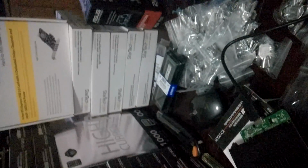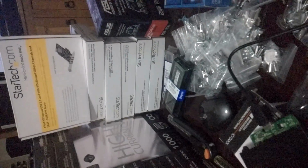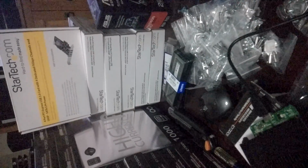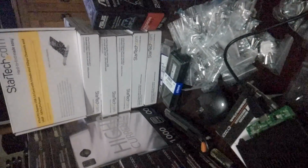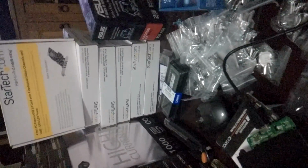And because we're essentially making one giant cluster from all these drives, there's going to be a lot of I/O traffic and just background overhead. I can't flood the controller that badly, because once you start getting to all 30 of these, your bandwidth is just going to be nothing. Even at 5 gigabits, it's going to be nothing. So we need separate controllers.